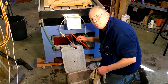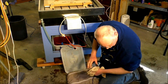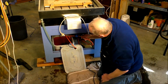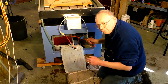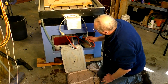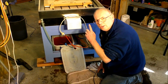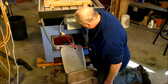This is the return back from the spindle, the router head. Let's see if we've got a flow — it might take a minute or two to come through. Let's plug it in. Oh, this one's really pumping it through. Because it's a narrow bore, it takes quite a bit for the pump to push through this pipe, and there's probably eight to ten meters of it. Then it's going to go through the body of the spindle motor. So we're happy that's working — and it's quite a bit quieter than the other one too.